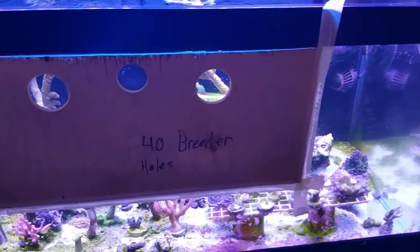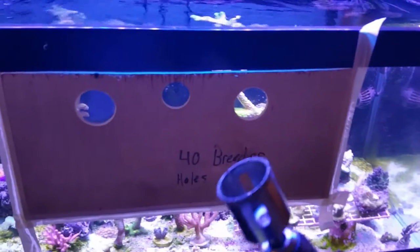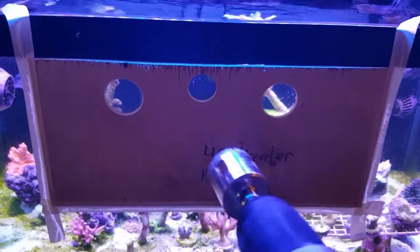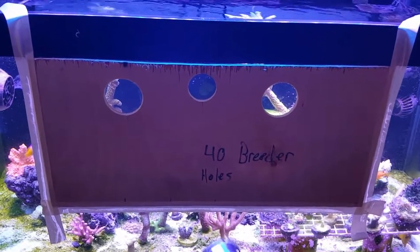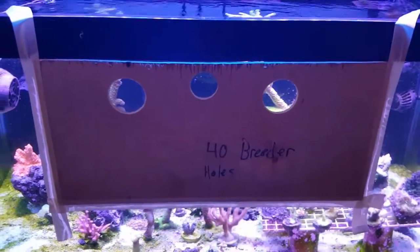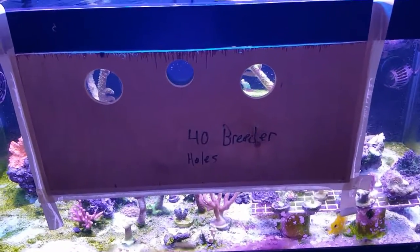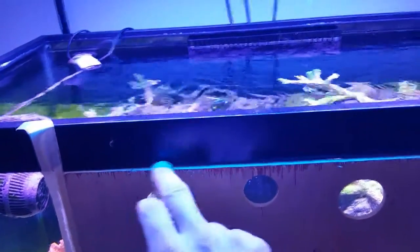If you don't have a wood hole saw, you can use the diamond bit for it. The wood hole saw is a little better because it has a lead, whereas the diamond bit is just a circle, so you have more control over where the hole's going. Without that lead it's going to bounce around a little bit. Whichever method you choose is fine, as long as you get those holes exactly where you like. Another benefit to cutting your holes in wood for a template is that if you make a mistake, you just scrap it and start over — it's really cheap wood, no big deal.